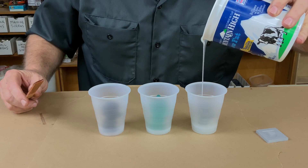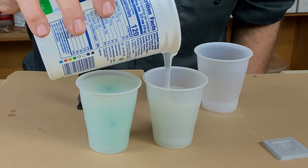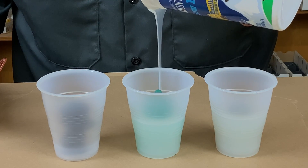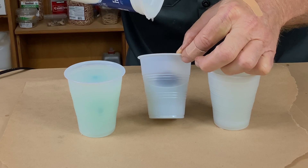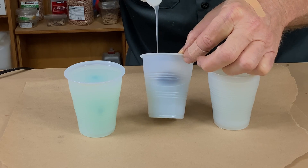Defiant is a pleasure to work with. It was easy to mix and de-air, and it's got a really nice pouring consistency. As always, I'm pouring from the bottom up, letting the rubber push the air out of the way, and being careful where it passes through the gaps between the arm and the body. I was also careful to make sure I didn't catch any bubbles in the deep sockets in the eyes.